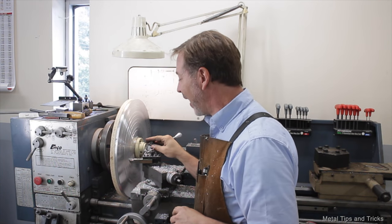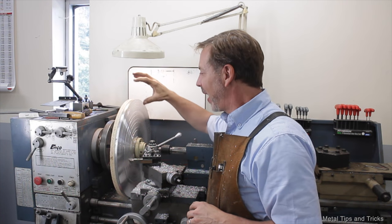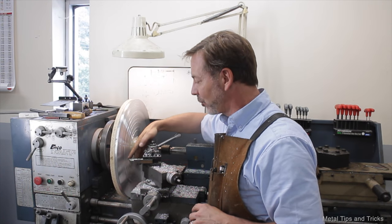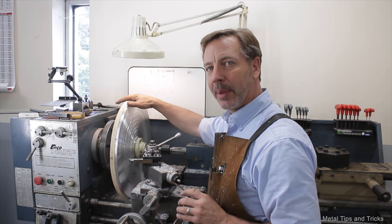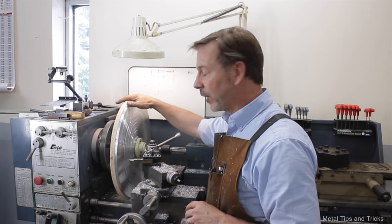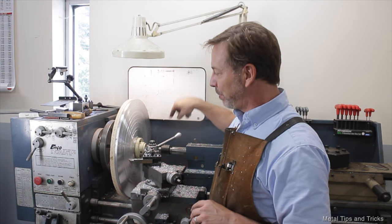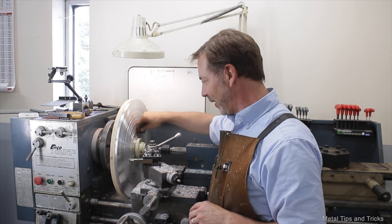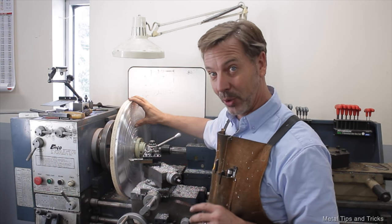All finished up. I think it's amazing — the new finish went a lot faster than I expected. I'm not exactly in love with the stair-steps, but it saved material and saved me a lot of time. At the very end I actually changed cutters — I went back to that original one to do the last bit. I also brought the RPMs up from 90 up to 430 RPMs, and that cleaned it up quite a bit. Interestingly, at that speed with the disc being out of balance, the machine was moving a little bit, but it didn't affect the finish. The final quality is really good, and I don't have to hold any particular accuracies.